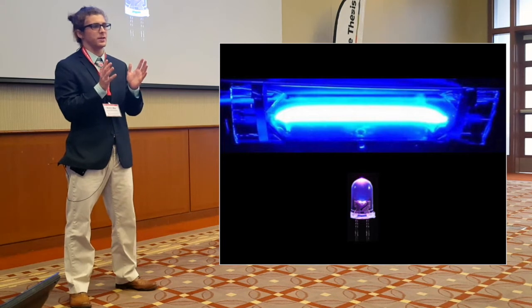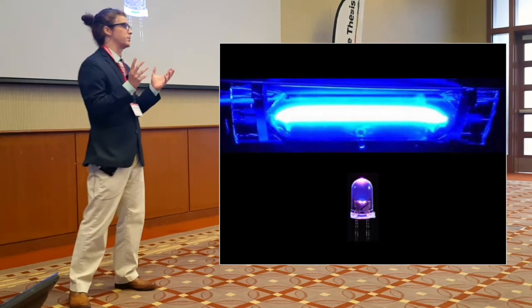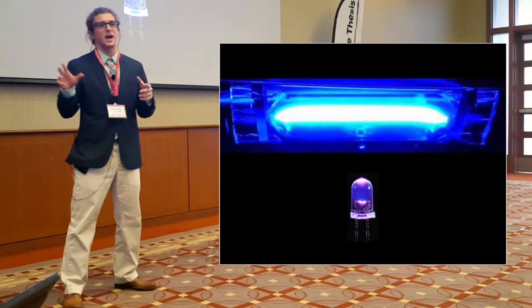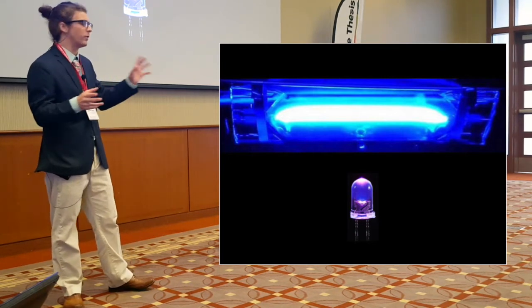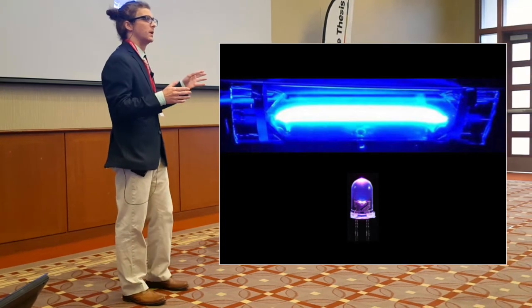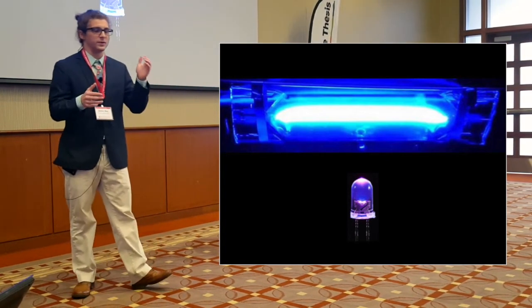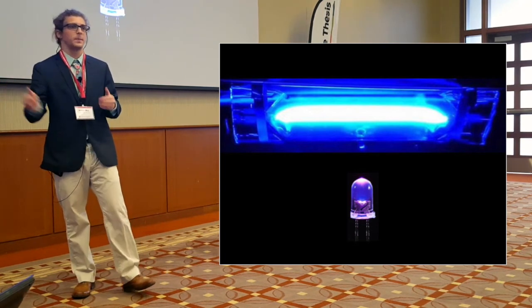But a cool thing that you can do when you use nanowires and metals in conjunction is you can enable flexible optoelectronics without any added device processing. And this opens the door to high throughput manufacturing techniques such as roll-to-roll fabrication. I've already demonstrated working ultraviolet LEDs on metal foils, and I'm now working on increasing the efficiency in the germicidal regime in order to move towards that large area high throughput manufacturing scheme.